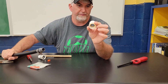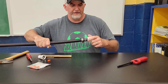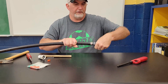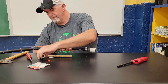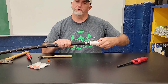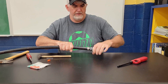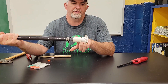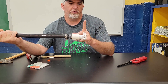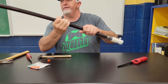Next we take the piece of PVC coupling — remember, it has threads on both sides. Normally I'd put a little Teflon tape on here, but I'm going to take a pair of channel-lock pliers and tighten this up. Then this is the garden hose adapter, and I'm going to screw this into the coupling and tighten it with pliers. With Teflon tape there shouldn't be any leaks whatsoever. So we have the garden hose adapter connected to the coupling, connected to the piece that goes into our black pipe, with clamp, plug, and clamp.